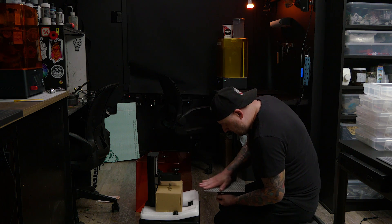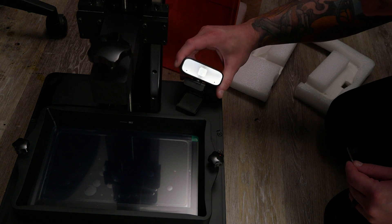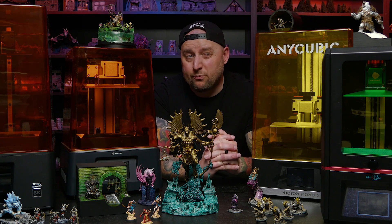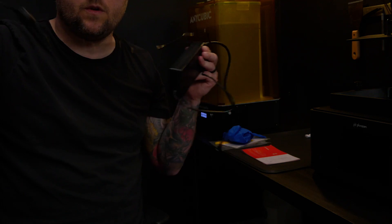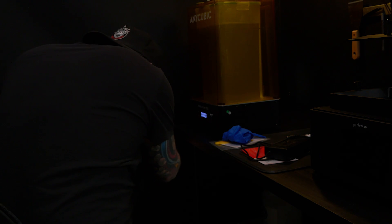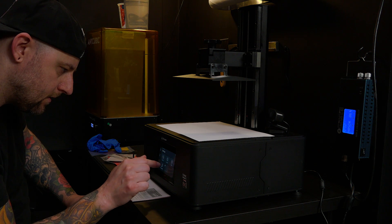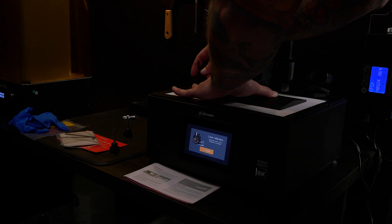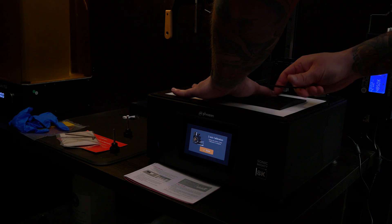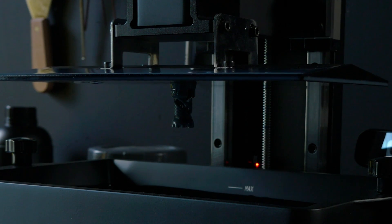Unpacking it, it felt great — high quality, everything really nice, lots of metal parts. It had some neat features, like a built-in webcam you can set up to monitor your prints from a device. I'll be honest, I think that's kind of gimmicky and I'll likely never use it, but I'm sure it'll be handy for some folks. The only problem I noticed during unpacking was that the included power cord was really short — actually too short to reach where I needed it to. Thankfully it's just a generic cord that plugs into a power supply, so I just switched it for another one. It has a beautiful, big, clear color display, and that was part of the reason leveling the machine was a breeze. I leveled it on my first try with no issues — on-screen displays told me how to do it. Easiest printer I've ever leveled. So I printed the included test print and it printed beautifully with nice sharp details.